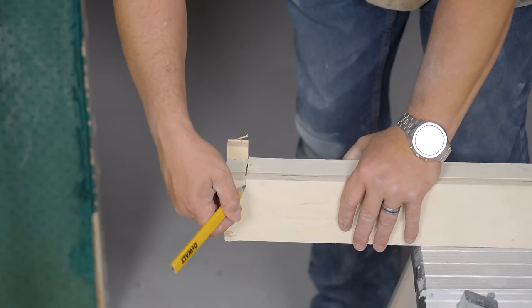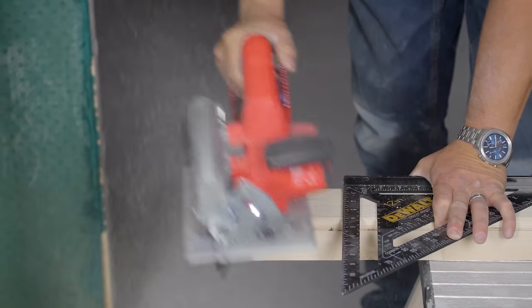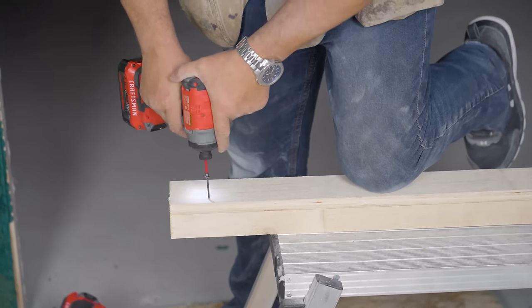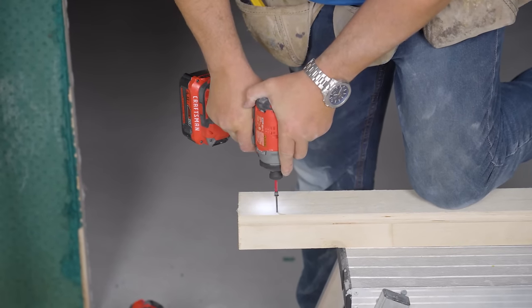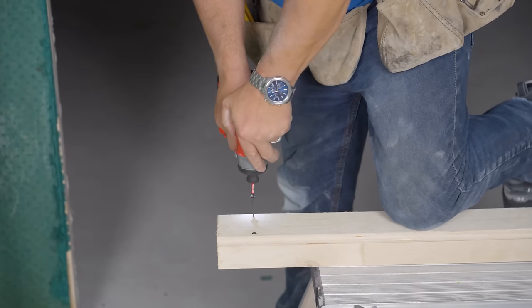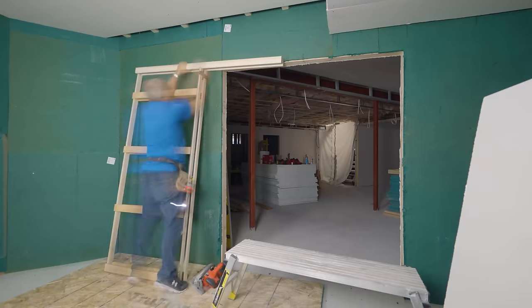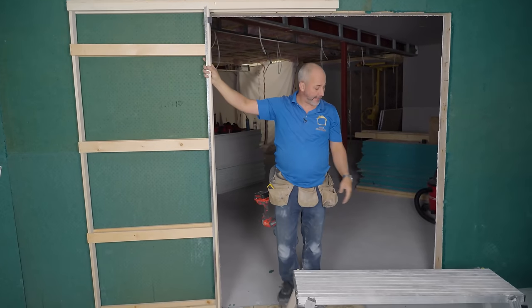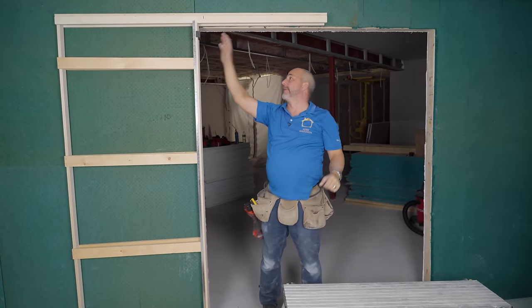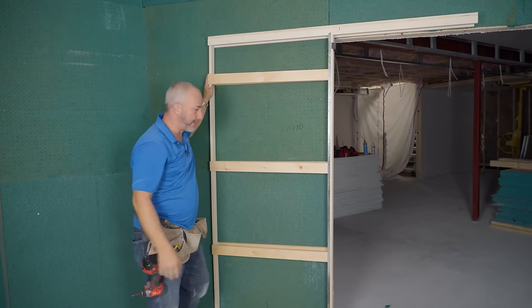We're ready — pocket door, French door style. I just need to continue the subfloor and measure the same frame back to this location, cut it, join it together, then finish with new trims all the way to the outside. I need two-by-fours to make a couple of boxes to mount floor to ceiling, screw the frame to that box, duplicate it on the other side. I'll align my two-by-four inside the tracks and use it like a header to make it one piece — the more things are floating around independently the harder it is to finish. Once the top and bottom are in I can use a three-inch screw through to the posts. Measuring shy at 99-and-1/4 is intentional — easier to put up a shy wall and pull it in than to try to get it perfect.